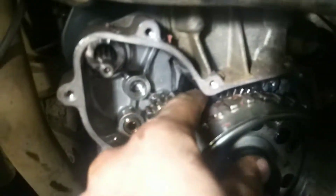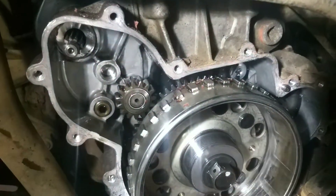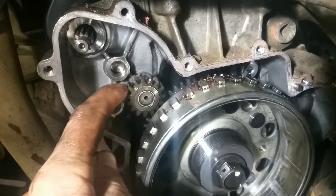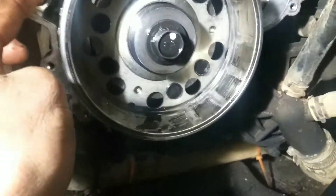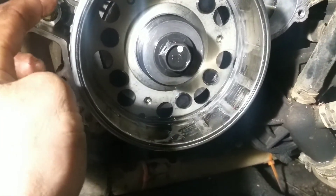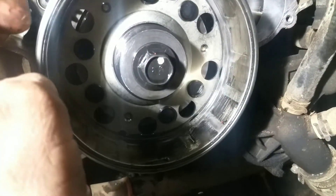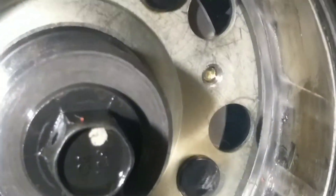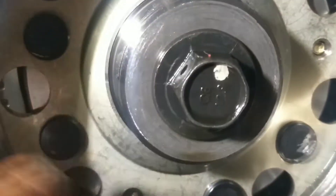Come to think of it, it's got to be backed out way out. This little gear is running on the backside of this bigger gear back there. See how that bigger gear is moving — it's behind this thing. There's a big gear on the flywheel. Look at that thing moving like that — it shouldn't do that. There are three bolts there, and those things have all backed out, all three of them.